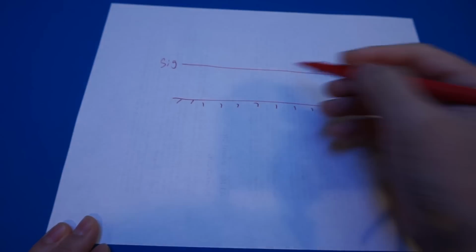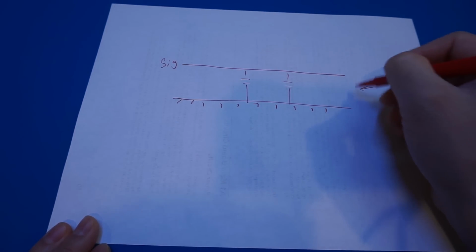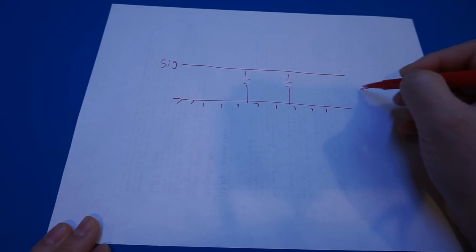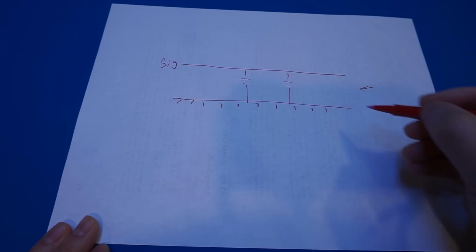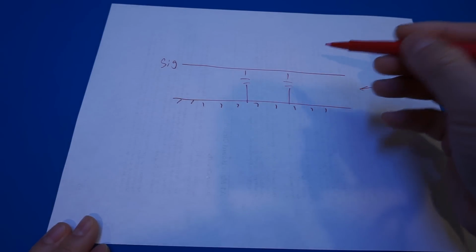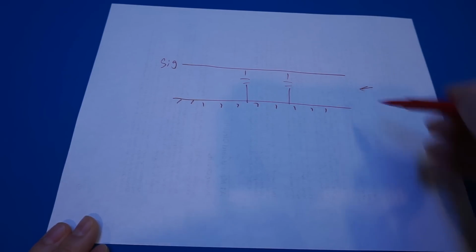When this wire is long, we have this stray capacitance distributed everywhere, so that when you are looking at the port at the other end, you will see this whole thing as capacitive. If you were to measure a capacitor here, you're going to be adding to the actual capacitance all the stray capacitance on the wire. This is fine, you can always null it out, but if the wires are long and you are moving around, this stray capacitance changes from time to time, and it will prevent you from making a valid measurement at the other end.